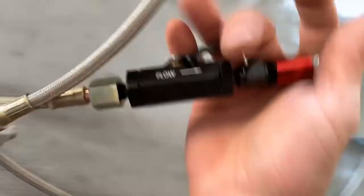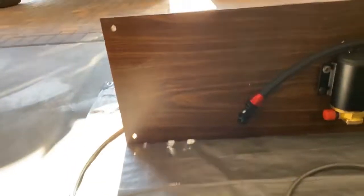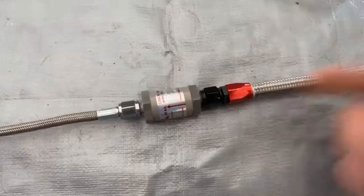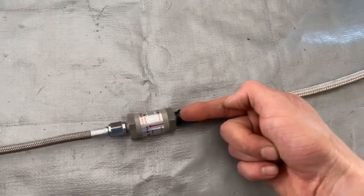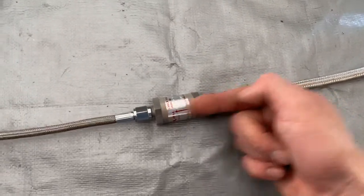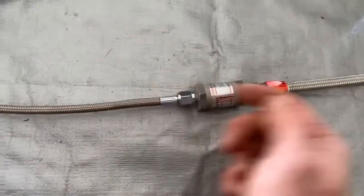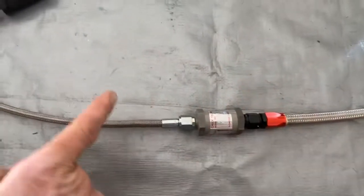Sorry, the sun is bright right there. From the shut-off you also have your control valve — it is directional, it's a purpose-built piece. You have your long line going all the way around down the frame to your check valve. It's directional — you don't want to go the wrong way. The arrow must face the right direction or you will get zero flow.